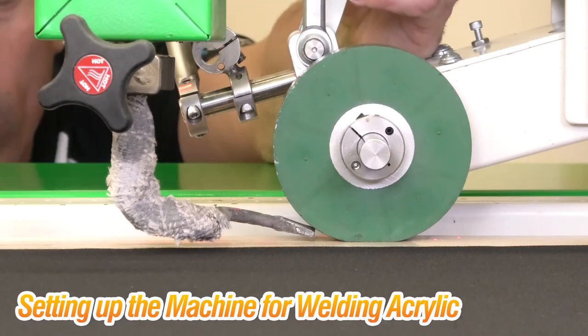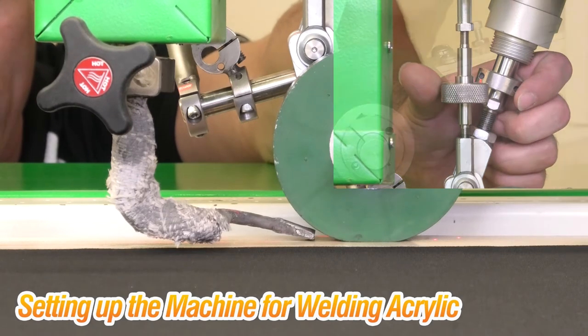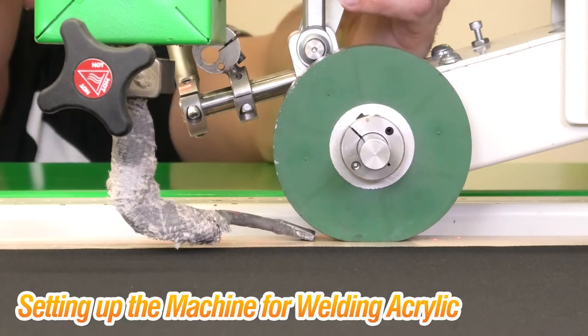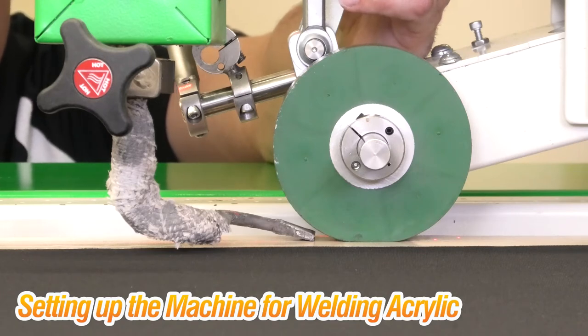If my nozzle is too low — I can adjust it counterclockwise — the nozzle moves down and we end up rubbing this acrylic material, heating it up a lot and possibly making the acrylic surface smooth. We do not want to do that because we want to penetrate the heat through the tape to get the tape very sticky to bond to the fibers and the acrylic material. If we burn the acrylic and make it shiny, our tape will adhere less than if the surface is not smooth or shiny.